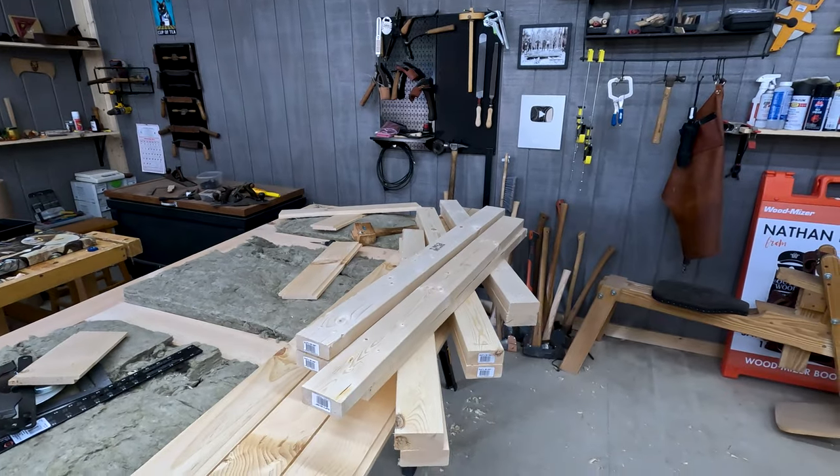So that's what happened. This is just over 10 feet long, and I need to break this down into 6.5-inch wide cants. And once we do that, we'll saw them down at 4/4 on the thickness. They'll go on the pallet that we just built, probably tomorrow, because it's getting late. I think I'll just get this sawed up. We'll do the pallets tomorrow, because I need to saw up a bunch more poplar, more than just this log.